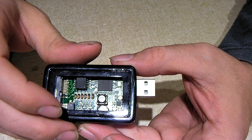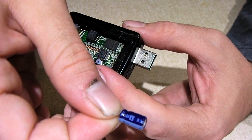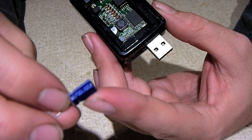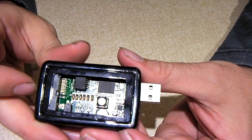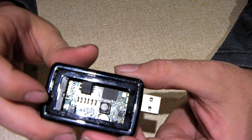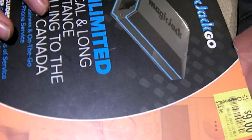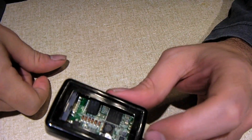We're going to try to change out that capacitor, and it's going to be a little bit tricky because I don't have surface mount capacitors. All I have is this through-hole capacitor right here — a 100-microfarad electrolytic capacitor rated up to 35 volts. I should also mention that if all else fails, I do have a new-in-the-box MagicJack Go that my mom found on clearance at Walmart for $9, so I do have a backup option.